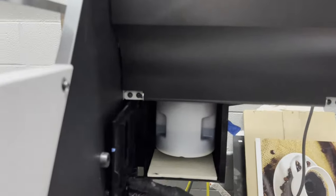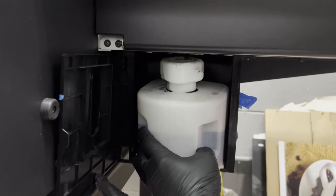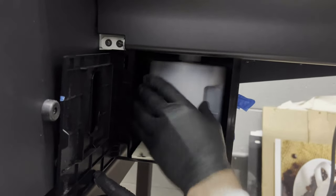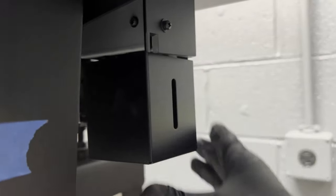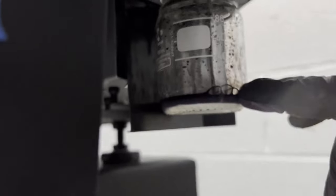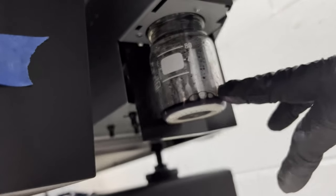Here's your waste ink. Inside your waste ink — when I do my maintenance, I always check this. That's your waste ink bottle. But here's the one that gets overlooked quite a bit: if you have a wiper, this glass bottle that's under this little cover right here — when you pop it off, you want to keep an eye on this. If this ever gets too full, it'll suck ink up into the pump and ruin the pump. So this is something you need to keep an eye on — I would check this weekly.